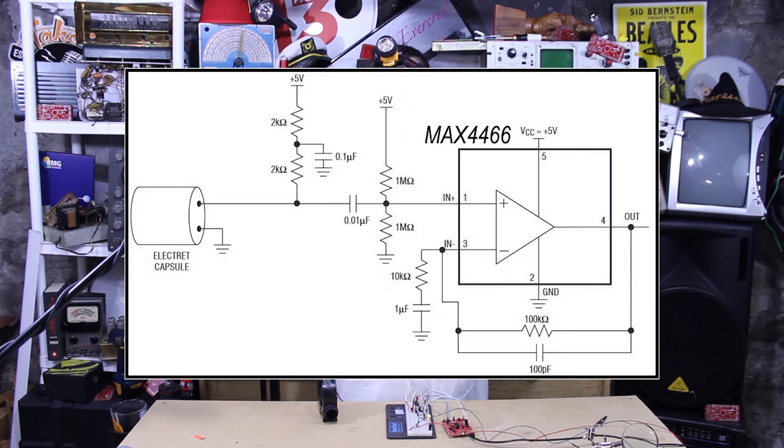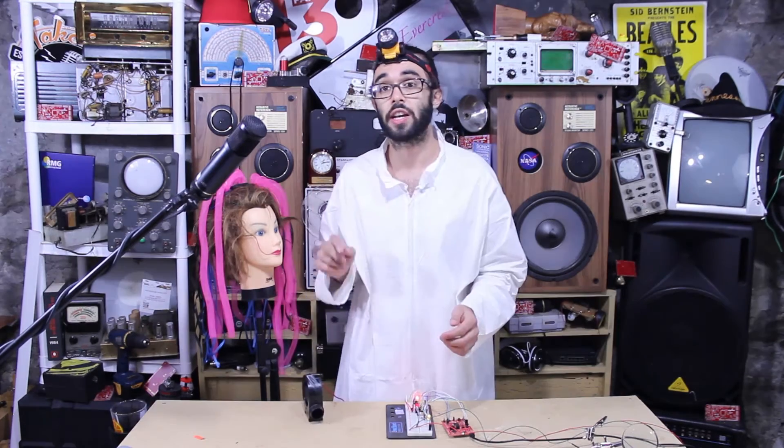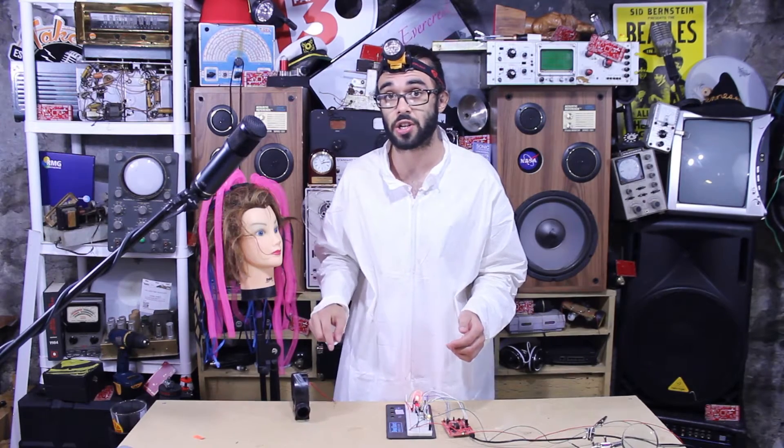For this project our amplifier is built around a single NPN transistor, but in general you'll want to implement a nice op-amp based circuit for amplifying the electrical signal. The microphone plus preamp circuit converts audible sound into an electrical signal that the LaunchPad can read via its analog input. When the LaunchPad detects a double clap, it drives the transistor into conduction so that current can flow to the relay coil.